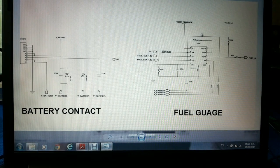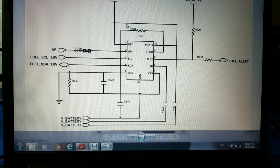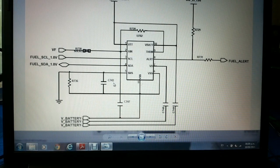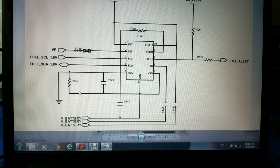Here is the battery itself. Here is the fuel gauge chip where I found my capacitor in trouble — the one I already changed. Maybe it's not your problem. This is the same chip shown in a bigger view. As I mentioned, it doesn't go directly to the ground — it goes to the battery and not exactly to the battery negative. So we get an offset voltage here, and we use this serial resistor to put it on ground and get a measurement of the voltage.